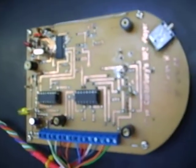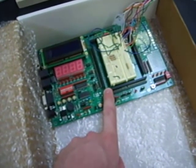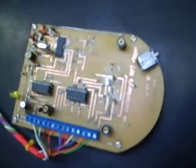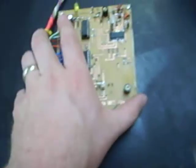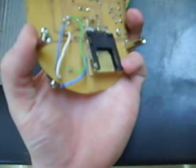This is it. It was a little bit nicer originally — I had a nice plexiglass cover over it. There was an on-off toggle switch here with a power indicator light. What this project uses is an evaluation board which has the Motorola 68HC12 microprocessor, which talks serially to the circuit board here. I couldn't tell you everything that's on here. I know that this is an MP3 decoder. Here's a crystal oscillator for a timer and a sprinkling of capacitors, inductors, and resistors. It has both surface mount and through-hole packages. I think that's a D-to-A converter on the back with a couple capacitors and an SD card reader right there.